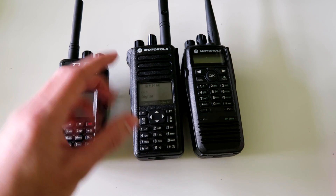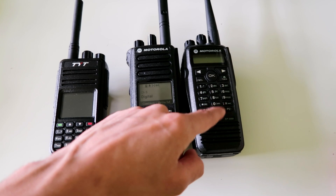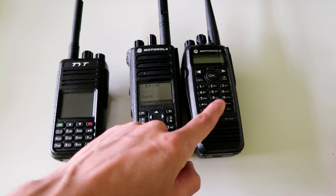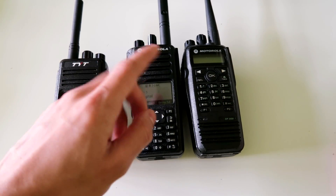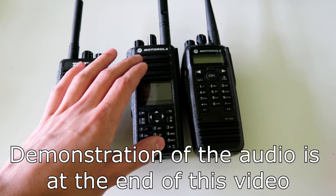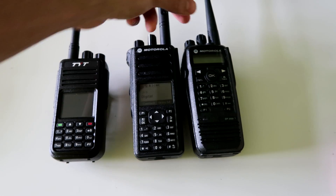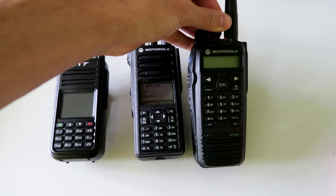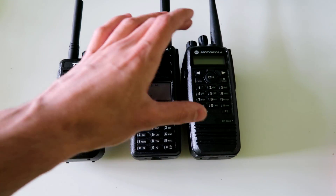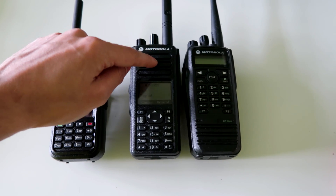There are a few reasons why I recommend the DP-4800 or XPR-7550 over the MD-380 or the DP-3600 or XPR-6550. Because it's newer than the DP-3600, it actually has much better audio. It also has a few fixes for problems in that radio — like the channel selector on the DP-3600, after a while it wears out and sometimes the channel skips randomly between adjacent positions on the knob. The DP-4800 doesn't have that problem at all.